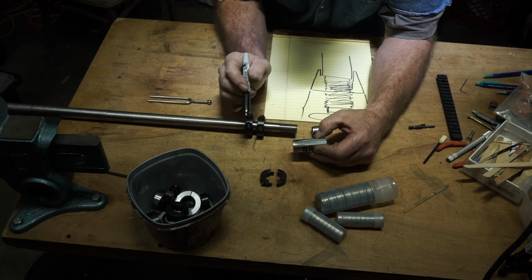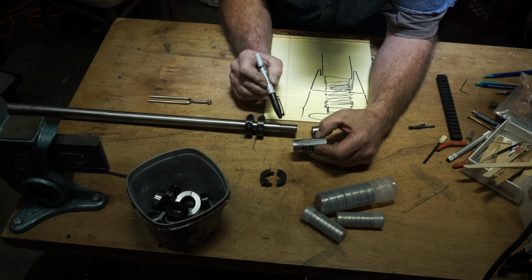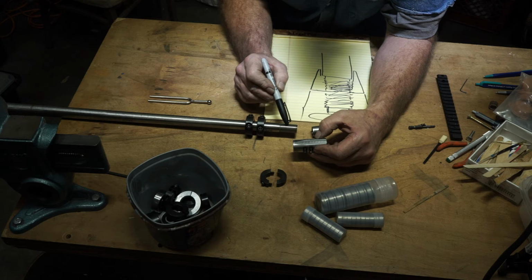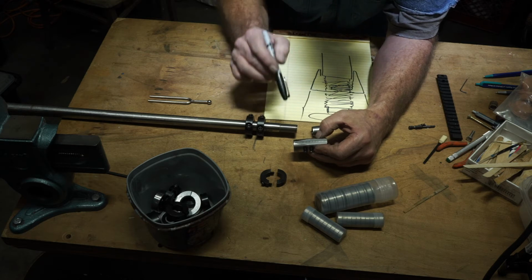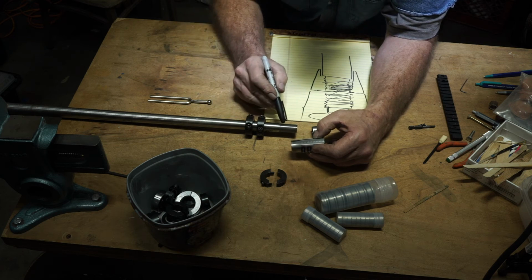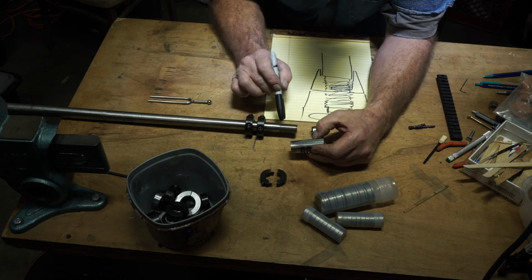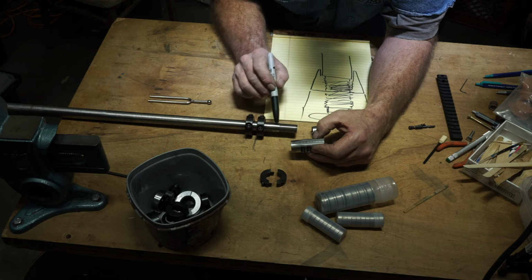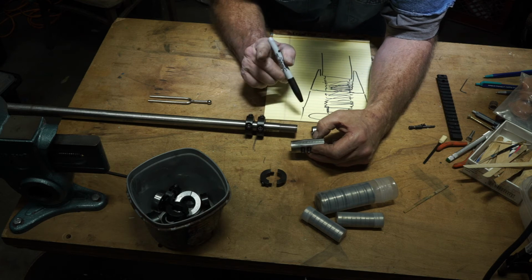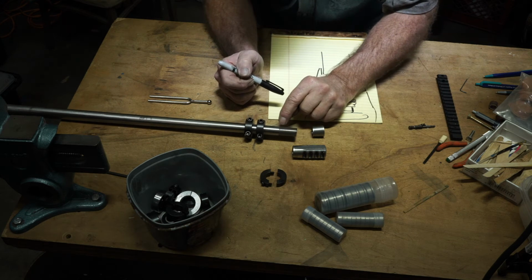That's not exactly true. I actually have a barrel that is 920 at the muzzle with a little half 24 muzzle brake affixment. The guy who put it together cut it all the way down to take a half 24, 20, whatever the half-inch ones are. So it's got a tremendous step here, and on that barrel, where the step is to like 50%, we're talking a 300 thousandths high shoulder here. Yes, I can run pin gauges into this end and meet refusal right at the end of the threads.